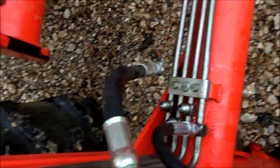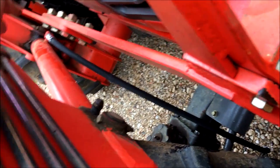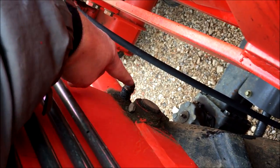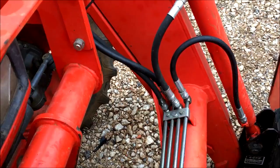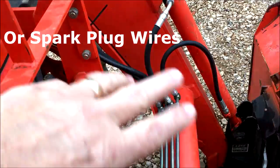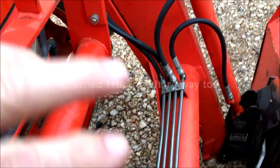It's pretty self-explanatory, just sometimes kind of hard to get to. This one I'm doing goes to the front of the hydraulic ram and comes to right there. The one with the L-shaped fitting comes to right there. When in doubt about hooking them up wrong, just look at the other side and figure out what it does — pretty self-explanatory. You can color code them, write numbers on them, or take a picture before you start. It's kind of like doing rear brakes on a car — don't undo all four at the same time or you'll have trouble figuring out what goes where.